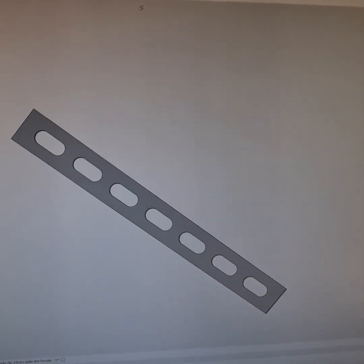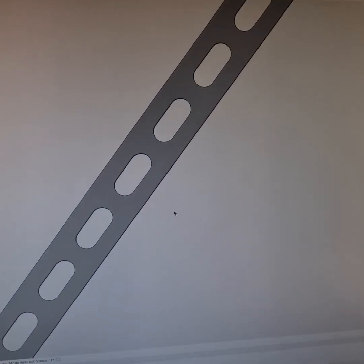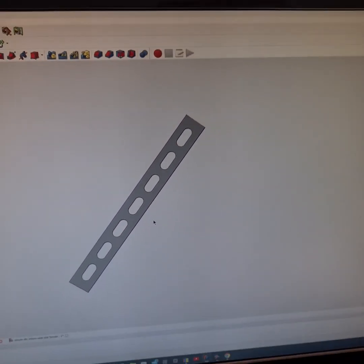I've quickly chucked together a design — that's the gusset we're going to use. It's going to fit on the project I'm working on quite well. I believe I've only got 1.2mm stock, so I'm just going to chuck this into a DXF file, power up the plasma and get some bits cut out.